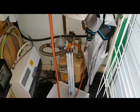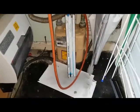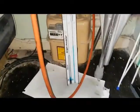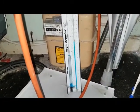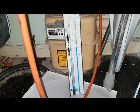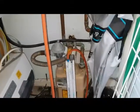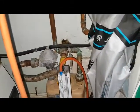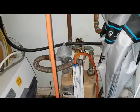What we discovered is that when we run the boiler for it to start, it goes to zero on ignition. I'll just demonstrate what's going on — it's just about to fire now, so watch the U gauge. That's the standing pressure. See it drop right down — so there's no gas on ignition. The boiler is right next to the meter as you can see. The valve's open, so it drops to zero. That's the governor — that's the problem. No gas when it comes to ignite.